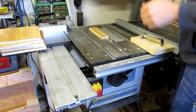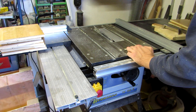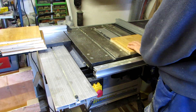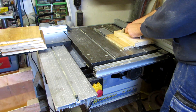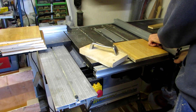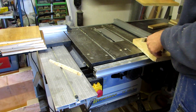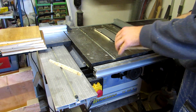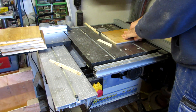In the end I have six squares, but I want to take advantage of the finish of these boards and don't want the edges to show, so I'm going to miter them. With the blade set to 45 degrees, I'm making a test cut in a piece of scrap to make sure that the edge comes out crisp and that it doesn't take too much away from the edge. This is important because I'm using the fence — if I run one side along the blade and it takes away too much from the edge, then flip it and run it against the fence, the other side will not be as crisp and the whole thing will not be as square.